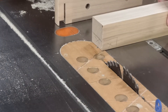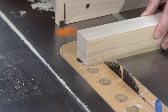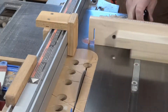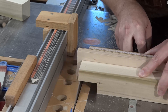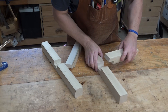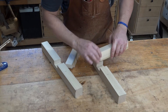What I'm going to do is cut close to my marked line — I marked this using the width of that wood — cut close to it, get rid of this material, and then just sneak up on it until it fits, until this edge is flush with this edge. I've got these all finished and cleaned out. They're tight — in fact, they'd probably be difficult to get together right now because I made them so tight. I'm going to sand these a little bit and that will make them a good fit.